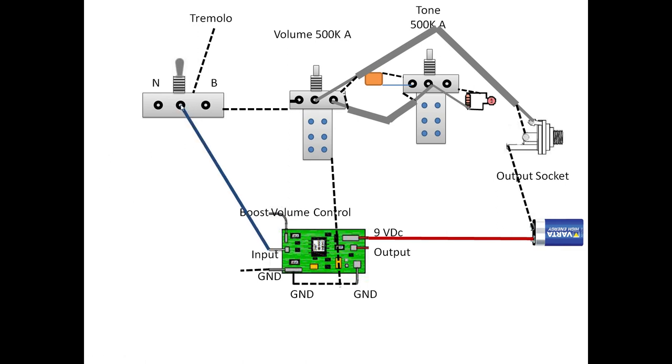Take one cable from the output of the three-way toggle switch to the input of the boost circuit, then take another to this point here, and take the output connected here. From the middle point, take one to this point. When the push-push is down, the gray connects to the violet going up to the volume, completing the circuit passively. When pushed up, the blue goes to the boost circuit input, then out through the red — connected to violet — so the boost is active going to the volume. This means we have two outputs from the toggle switch: one goes directly and one goes through the boost circuit.